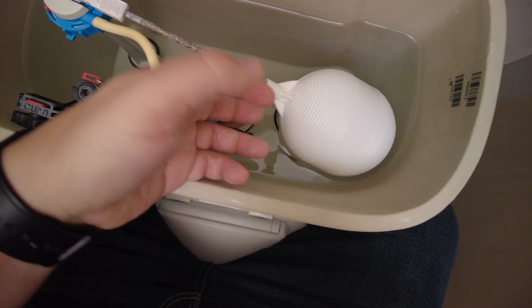That's in place, so I'll go ahead and hook up the chain back to this arm. Next, we need to disconnect the supply line underneath the toilet — just be prepared for water to come out. Now we'll unscrew the nut holding the fill valve in the tank; you might need a wrench for this. It shouldn't be too terribly tight since it's plastic, but sometimes it's tight enough that you can't get it started by hand. Just unscrew it and lift the fill valve out of place. There might also be a clip left over on top of the filler tube — go ahead and remove that now because the new one should have a replacement.